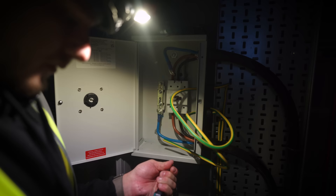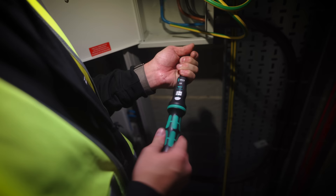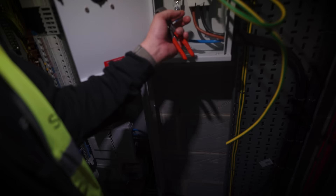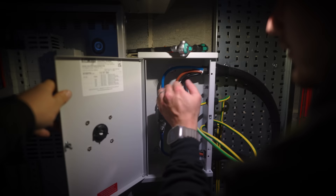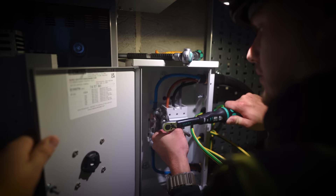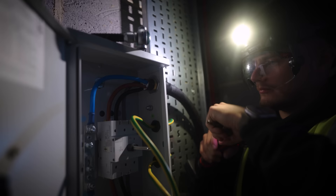Let's check the specifications. Main switch terminal: six Newton metres. Four mil Allen bolt: 15 Newton metres for the neutral. So we twist this all the way up to 15 Newton metres. This is where these 125 and 150 Cobras really come in handy — this is all I really use them for. Sometimes they're nice if you're doing a lot of stuffers as well.